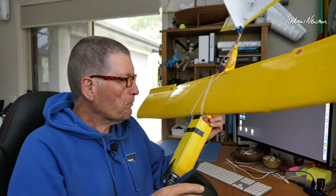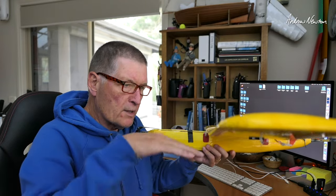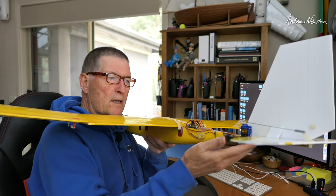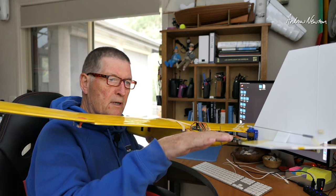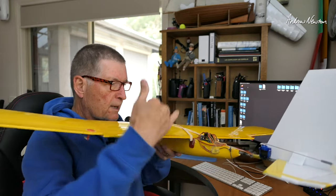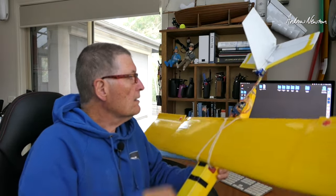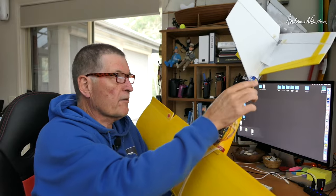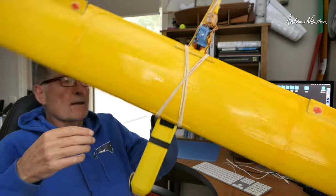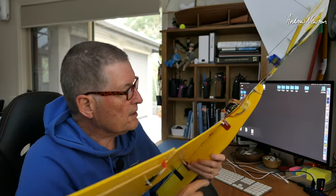Nice flat bottom for the most part. When it sits on the fuselage on the flat bottom, that actually gives it a few degrees of nose up angle of attack, which seems to be working out pretty well. I did put a little bit of angle on the tail boom so that the tail sits up a little bit, to again give it a few degrees difference between the tail plane and the wing, and that seems to be about right. A couple of cheapo servos down on the tail. Got a little GPS sitting up on the tail there. Matek F405 wing board. Express LRS receiver just glued on the tail.